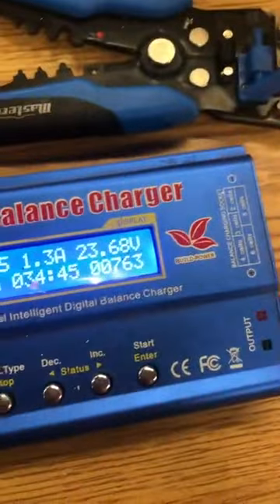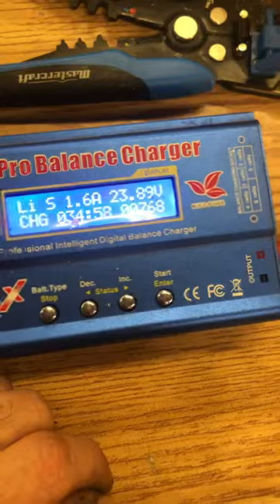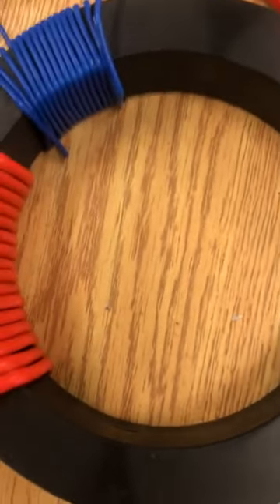So there's a draw — pretty minimal. Let's turn it off so you can have another look. Twenty-five point four sitting there, about twenty-three. It's probably pulling about four or five amps. Now those aren't full brightness, but they're damn close. If I go and change this back to how it was, you will see spectacular results just like before.